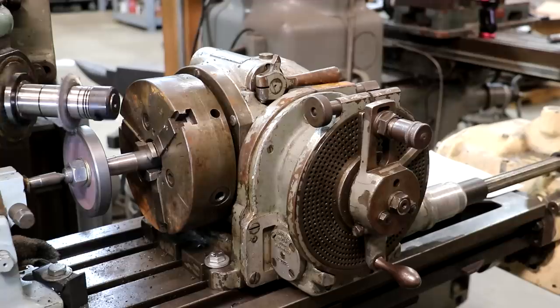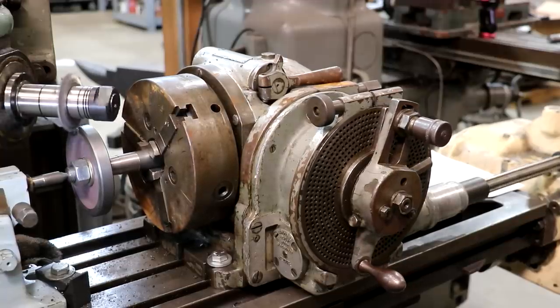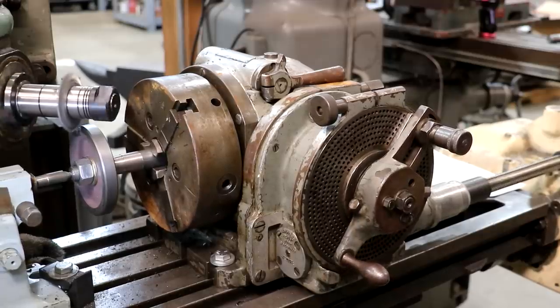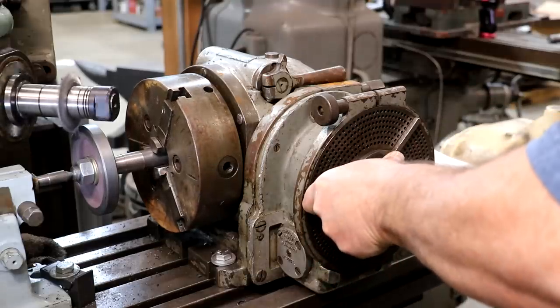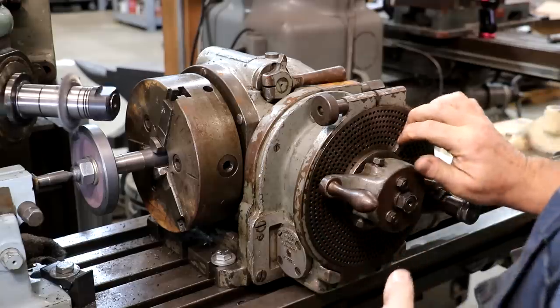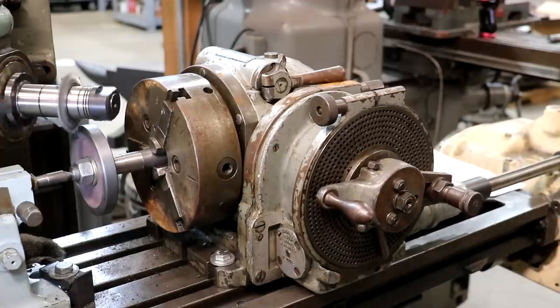Now we will engage the table and it's going to do it again. Notice that the whole head here is spinning, and it's going to do that same range of motion on every cut that we make, but we'll be changing the index with the head on here. Notice the lead attachment down here on this end — this is tied into the screw of the table. As it's moving out, it goes through a gear train to give us our lead, and it's going to rotate this on the dividing head to make it all work out.